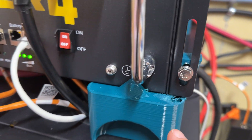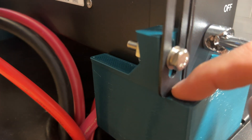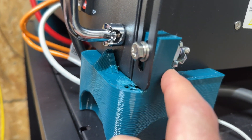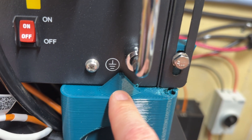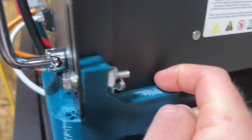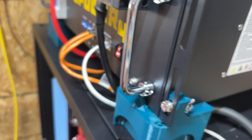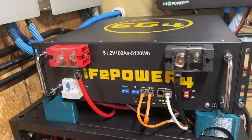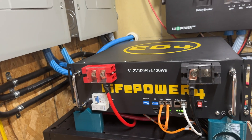I'll show you this foot right here — when I redesigned this side, I messed this part up. It's supposed to be flat here so these can go right down to the bottom, but I added a 45-degree angle on this side without realizing it. So I ended up cutting that off, and there's just a little guy here holding it from falling off. There's actually a lip right here that it rests on, and a pin that keeps it in place. If anyone's interested in these files, I'll put the link below — if it's not there immediately, give me a little bit of time.